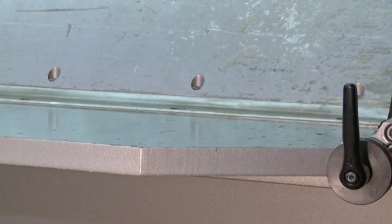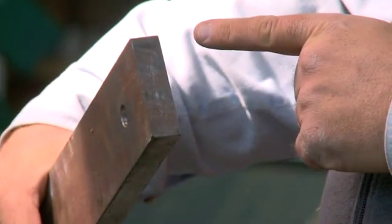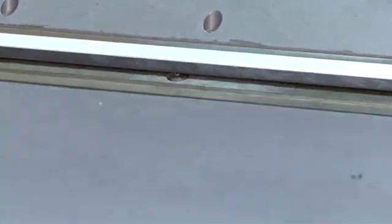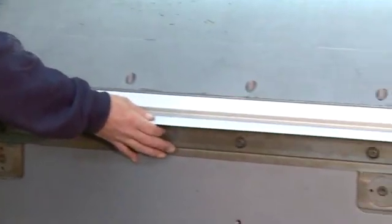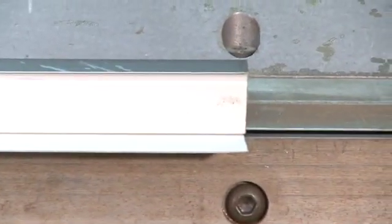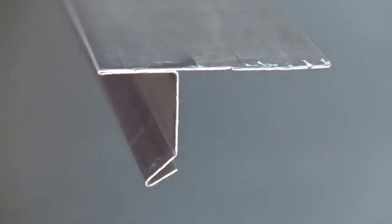Our bending leaf is made of solid steel and has a shorter footprint, allowing the operator to stand close and comfortably next to the machine for hours. An optional heavy bend bar is available when using the maximum capacity of the auto brake. By simply unbolting the bend bar and flipping it upside down, you can create Z and short offset pieces very easily, producing your finished part in a fraction of the time it takes to bend on a hand brake.